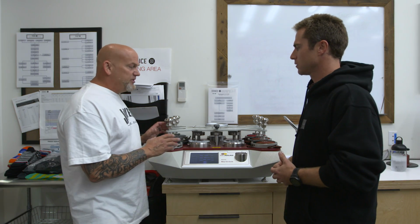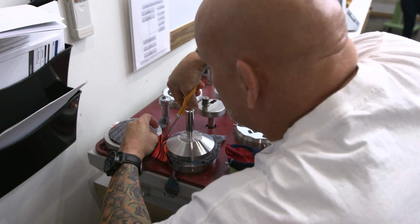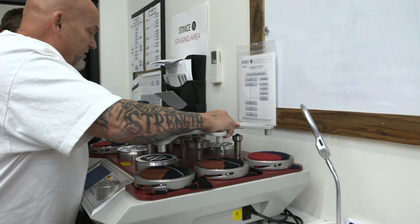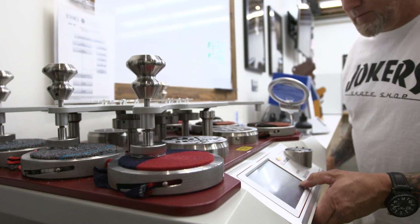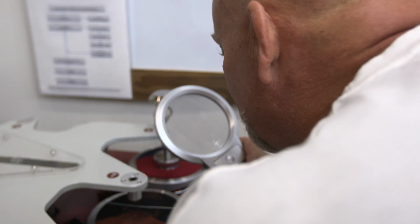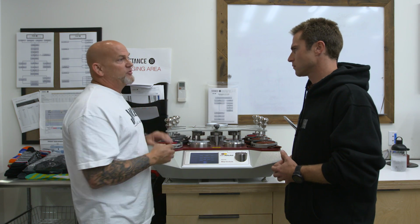This is where the rubber meets the road in terms of identifying the durability of a fiber that is used for any type of knit or woven product. In this case, these are all knitted socks, and we're going to do a straight line abrasion method, and we're going to run these socks until failure. Failure is indicated when you start to see a hole propagate into the sock. We will stop it, note the cycles onto our control sheet, and continue on until all of the samples fail.